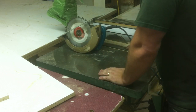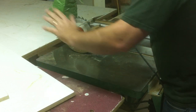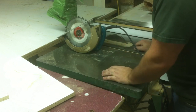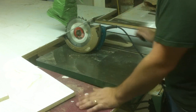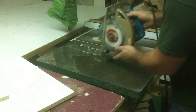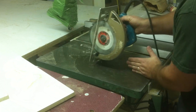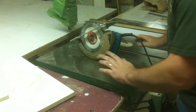My plan, before I do any cutting, is to make some sort of flat platform and a little homemade lathe with a couple of pins to mount it. I'm going to have to make some sort of little gearbox because I want this lathe to spin super slow on its own — not by hand. The skill saw will be mounted in a slide mechanism that moves back and forth and in and out, with a pin directly behind the blade to follow a contour and carve out a copy.